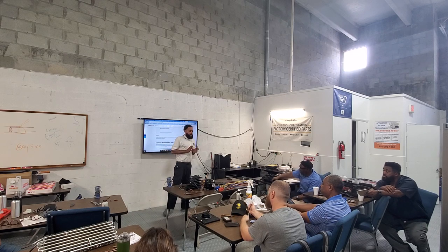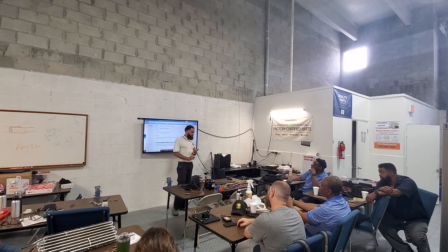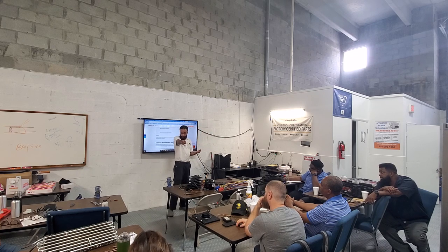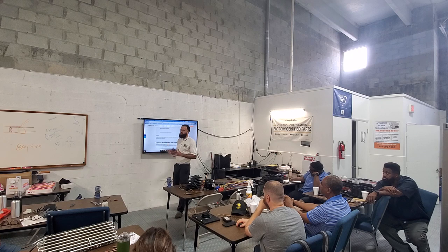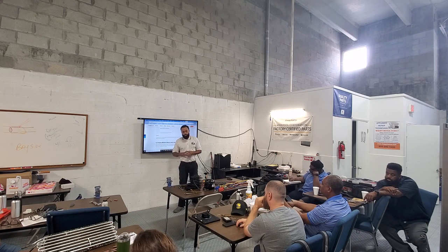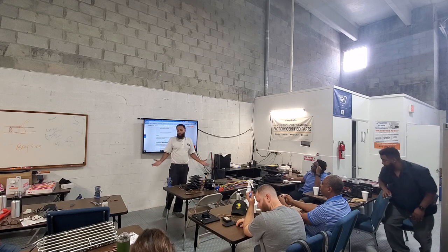Now, we tapped in, right? So we said already, we're going to have one of four nightmares. We said an inefficient compressor. We said a restriction. And we said on the charge, an overcharge. Somebody might have worked on it before, and they put too much pressure in the system. Or the unit itself has more than it's supposed to.